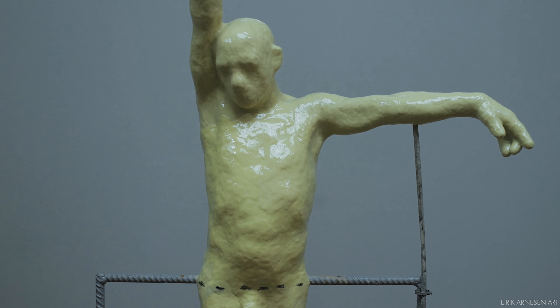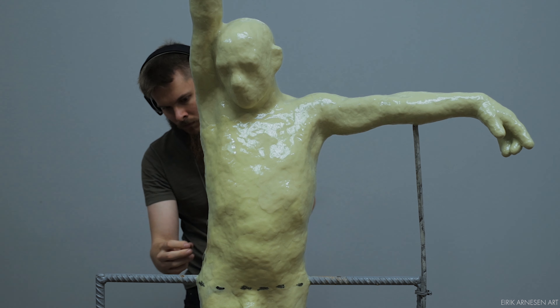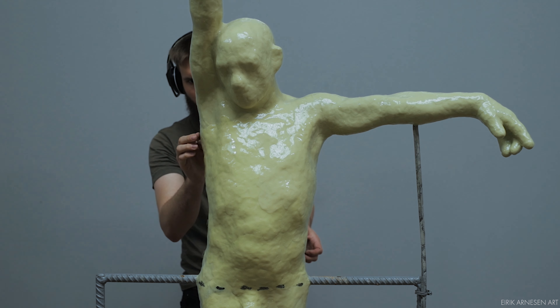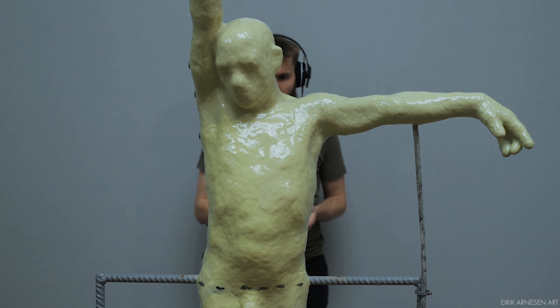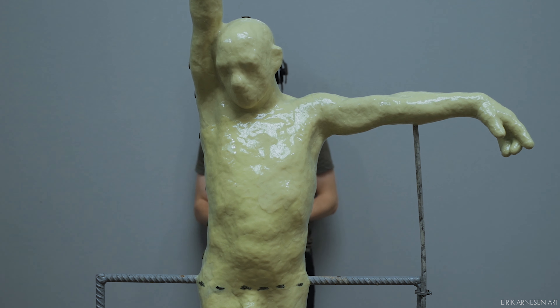The upper half will be the easiest so we'll start there. The view you are watching right now will be the front half. I chose this and not 90 degrees to this view because this puts my seam in the least offensive place — on the sides of the figure running up the flanks, and not right across the middle of the face. This view also left me with the least amount of pieces to make for the mother mold in order for it to open. I also want to find where the upper half is at its widest, which is from the direct front view. Finding the widest view and splitting it in half tends to be the easiest way to make sure the mold will open. So I'm considering not only the silicone parts but also how the mother mold will be constructed — I'm thinking about how the entire thing will function once completed.